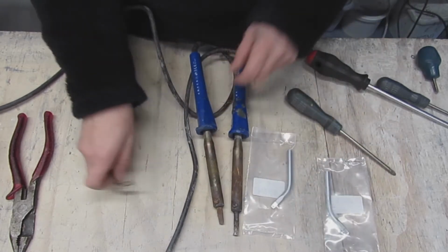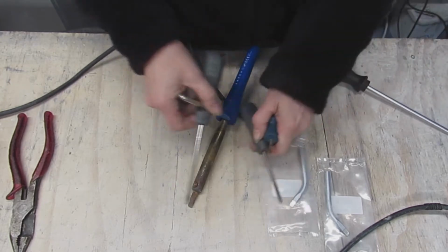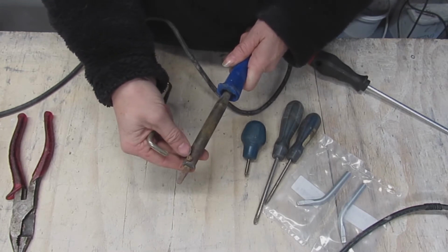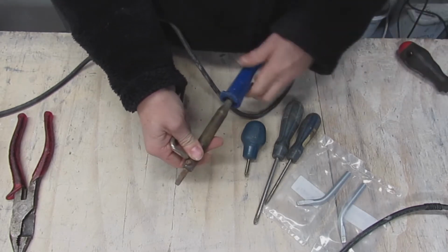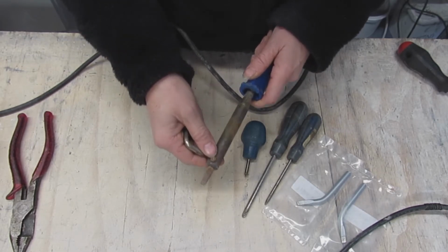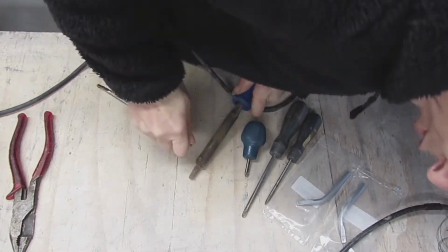So first of all, you can watch me change the tip. This is very gnarled, and I can see that it will gnarl. Gnarling means you put the screwdriver in and instead of turning the screw, it starts to sort of wear away the socket that you're putting the screw into. It's essential to get a screwdriver head that's exactly the right size to get the correct purchase. So this one seems to be best. It's the only one that will make it move at all.